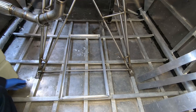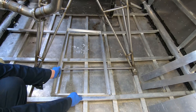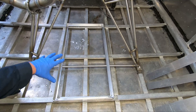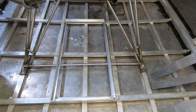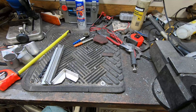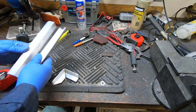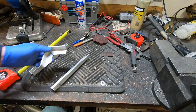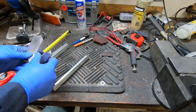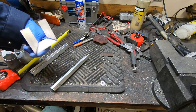To mount the actual fuel cell, I'm going to build basically a tray for it. This tray will be raised up above the bar, and I'll build some supports in there and then some metal straps to hold it all down. For the pedestals on the tray, my initial plan was to cut a bunch of these and bend them into feet — like this, a foot like that — welded onto the tray to raise it up.